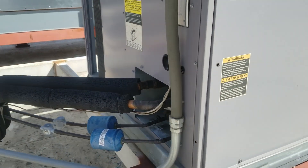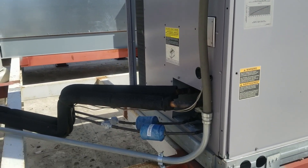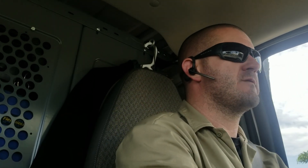I'll estimate in my quote that it's going to take 10 pounds of gas, but it probably won't. I'll let them know. To recap: we had a service call for a water leak coming from the fan coil unit for a split system heat pump — this is a 15-ton system. When I got there the drain pan had a little standing water in it so we blew out the drain just to be safe. The filters are at a slant, so it's a slanted coil, and I was looking at the water pattern because water had been dripping on the filters.